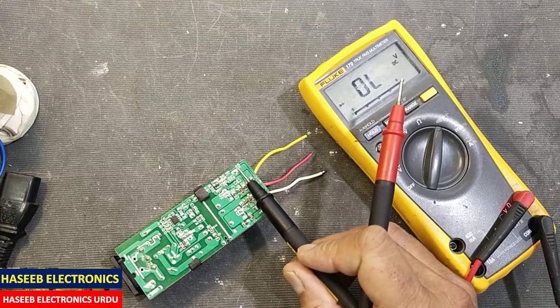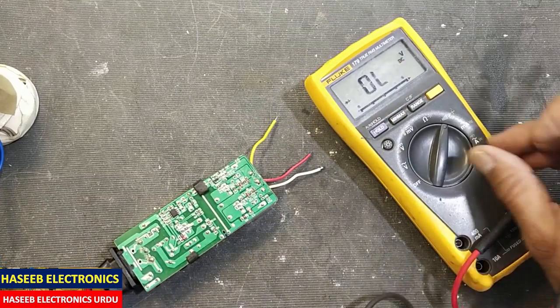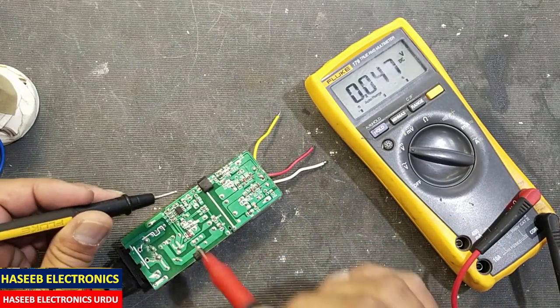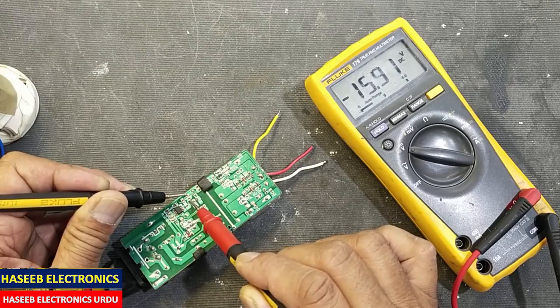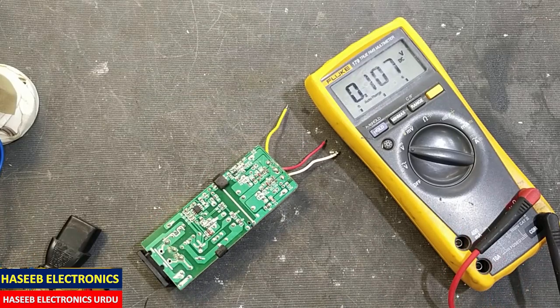But the IC cannot take feedback at this time. Let's verify the VCC capacitor — that is here. The VCC capacitor is at its maximum voltage, which is 15.9 volts. This supply is using a UC3842 IC. Let's check the output stage.